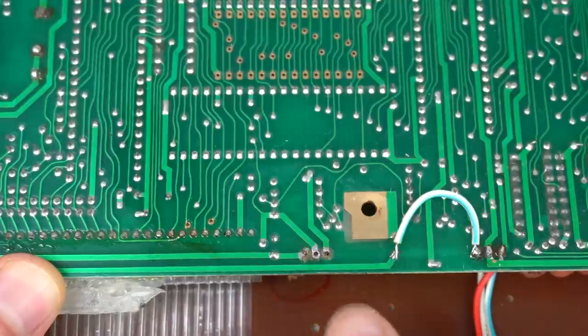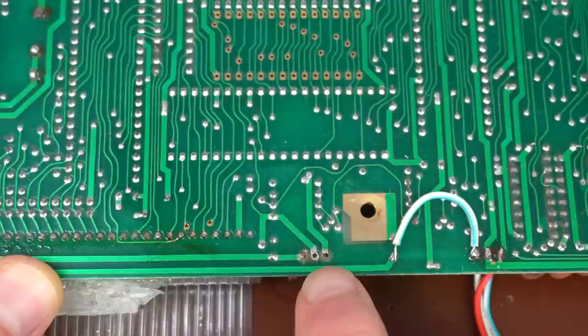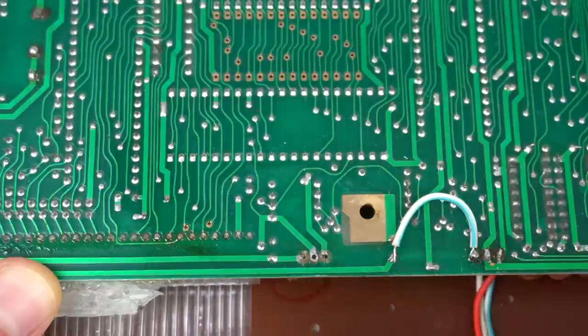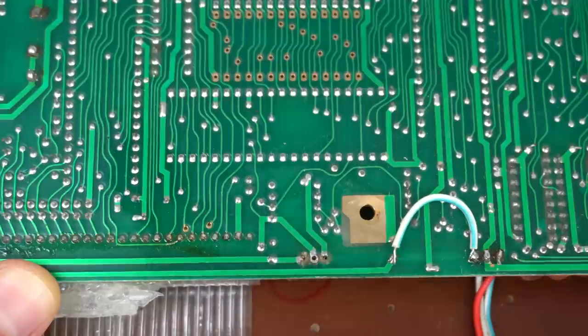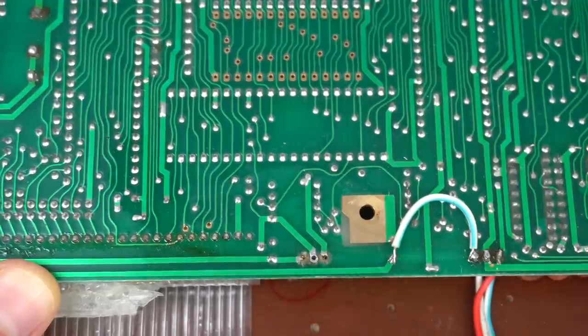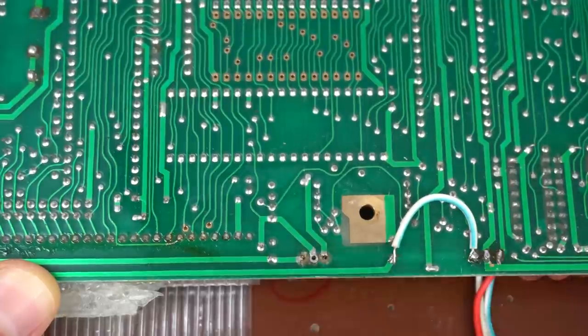Just give this a good cleaning after desoldering it. You can see that the pads of the tracks have been stripped from some other time. Whoever installed these cables did a rather poor job and destroyed those tracks. Now that's probably not a big deal - I suspect that we're making connection just fine. It certainly wouldn't account for the voltage regulator not giving out five volts on the output pin, but it's something to watch out for when I solder the new one.